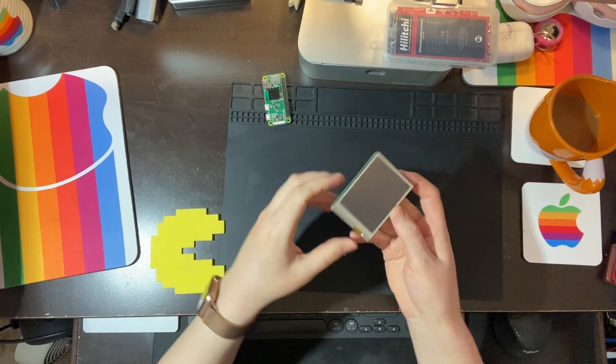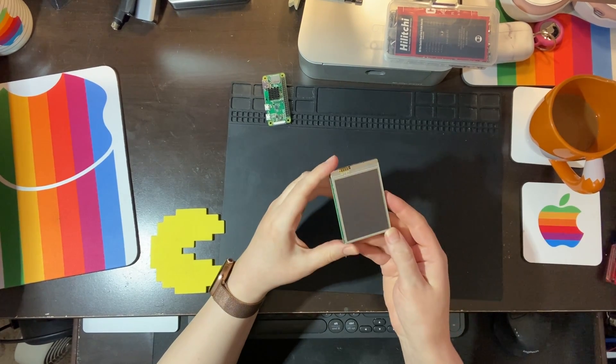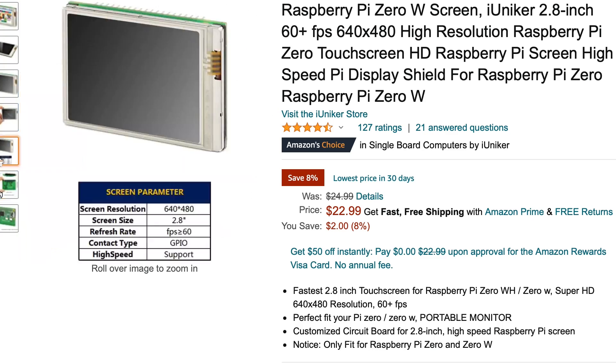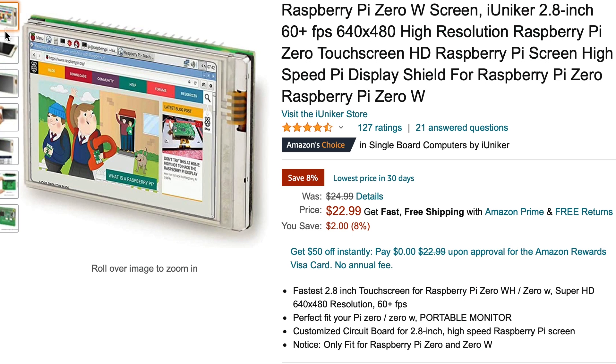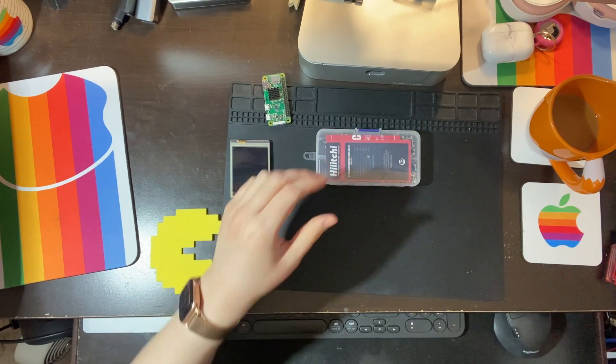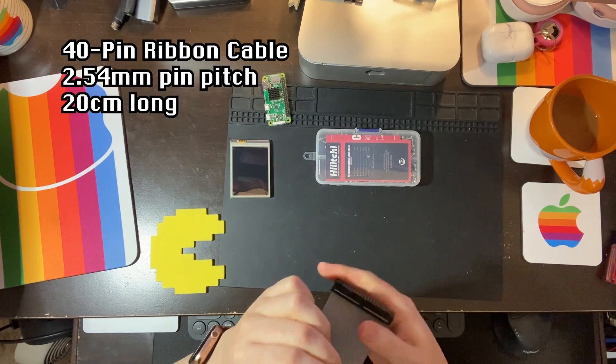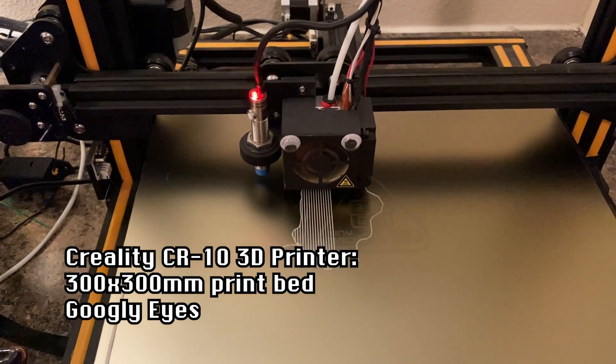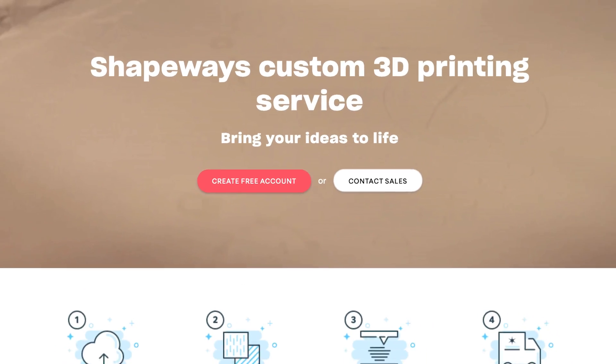First, let's see what materials we need. We'll need a Raspberry Pi Zero W, or a Raspberry Pi Zero. I'm using a W since it has built-in wireless and built-in Bluetooth. Also, a key part of this build is this tiny 2.8-inch display meant for Raspberry Pis, built by a company called iUniker. The 3D model STL file is sized specifically for this screen, so make sure you get this one, which is linked in the description or on the Thingiverse website. We will also need a set of M3 bolts and nuts to keep the case together, and a short female-to-female IDE cable to connect the screen to the Raspberry Pi.